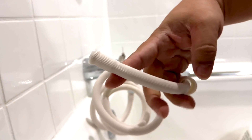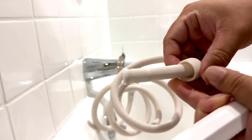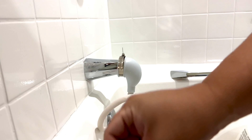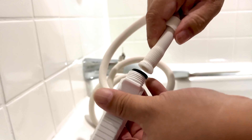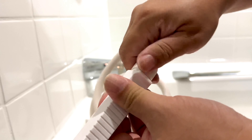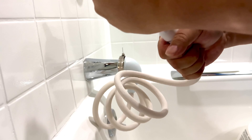I'm going to take the clamp and start twisting this down and tighten it until it seems pretty snug. That seems like it's on there pretty snug. Now you're going to put on the sprayer handle here — this is going to get tightened down with this little collar. There's also this little rubber washer, so that's going to go right there to make sure we have a good seal. I'll press those together, then bring down the sleeve and tighten it by hand as tight as I can get it.